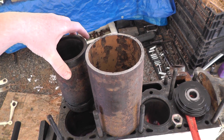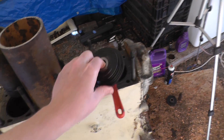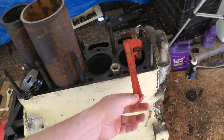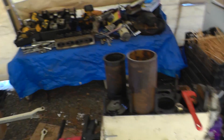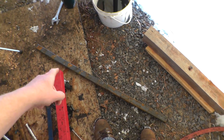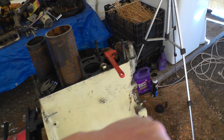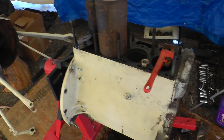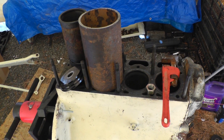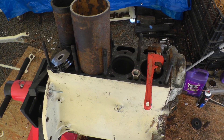Pulling that thing was really intense — incredible. I had to get a pipe wrench on there because I didn't have a wrench large enough, and then I used about a three- to four-foot steel bar on the end of it and really cranked it over to pop that sleeve off. It was really, really stuck in there. Anyway, this is your update on the Ferguson TO-20 project.